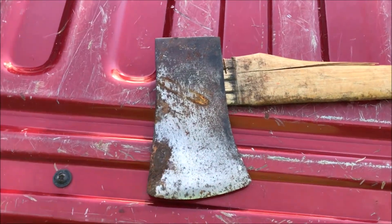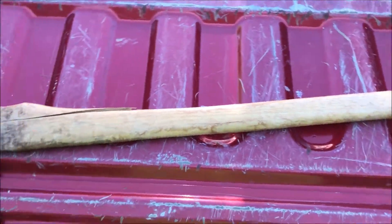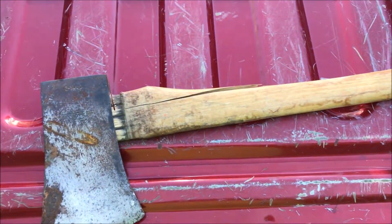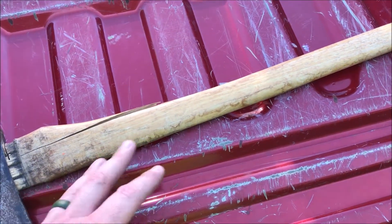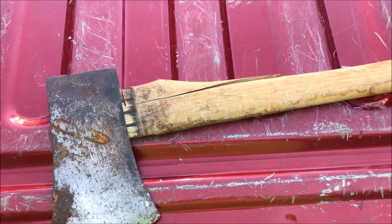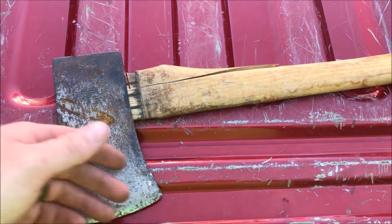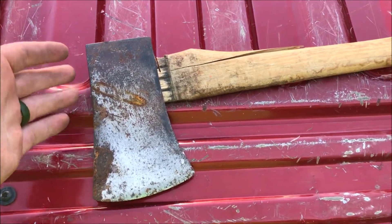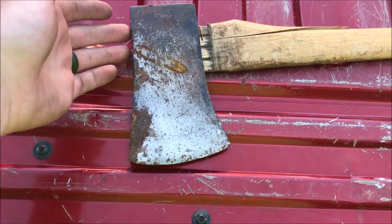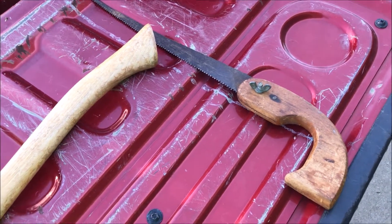It has this cracked handle that I'm going to have to replace, which is a real shame because I really like this handle — it has this nice fawn's foot right here and nice curvature, real pleasing to the hand. It would have been nice to just sand it down and put some linseed oil on it as is, but it has this big crack. I already started trying to cut it off, and I'm having some issues getting the wedge out — it's just a standard lengthwise wood wedge.